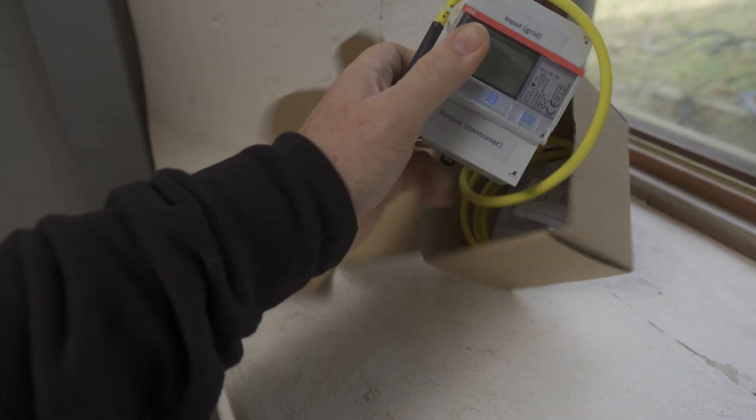Unfortunately, practice sometimes is to open the box, read the installation guide, and give it a go. But this is sophisticated equipment. It's got ports for Ethernet, MPPT connections to PV arrays, monitoring of an energy meter on the switchboard, and all of these things have to be configured correctly — including the battery installation and BMS monitoring. There is a little bit to it, but it's really well put together. All the cables are provided, you don't have to make any connections yourself. Even the meter cable comes with an RJ45 plug, and if it's not long enough there's an extender available.